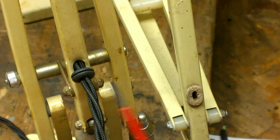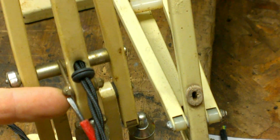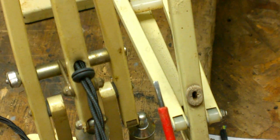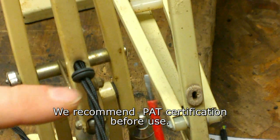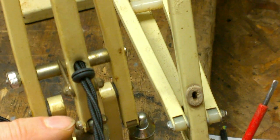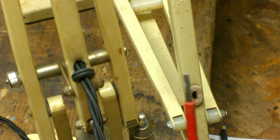One thing to note: this is a three-core cable so it does not need to have the earth point connected, because we intend this cable to run up to the lamp holder where it'll be earthed internally to the bulb holder itself. In some cases, if the cable isn't fine enough to fit up the arm, you may find that you have to untwist one strand of cable and run it to the earth point. That completely depends on your unique lamp and your cable choice.